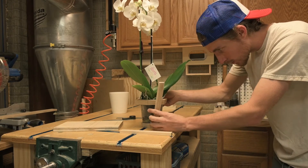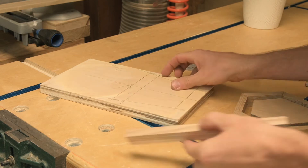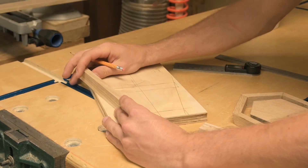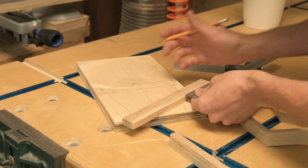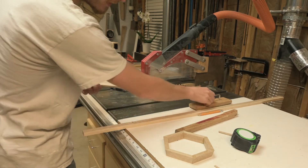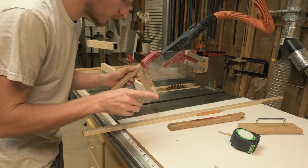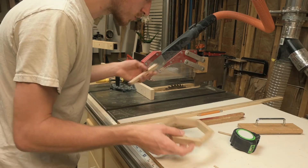With the flower pot pieces together we get an idea of how this comes together. We can figure out the length of the slats by measuring from wherever we want them to start on the bottom to how far we want them to overhang the top. We'll mark a glue line and then cut three-quarters above that as our cut line. There are going to be six straight center pieces, and then the two outer pieces on each side will need to be tapered — so we'll cut 18 pieces total and add tapers to the ones that need it.